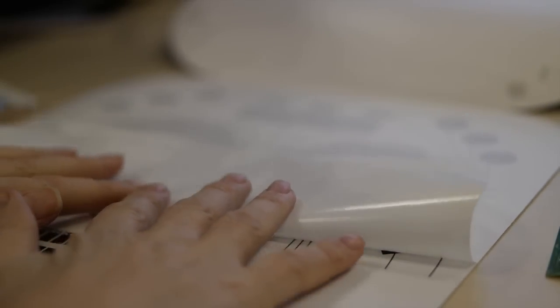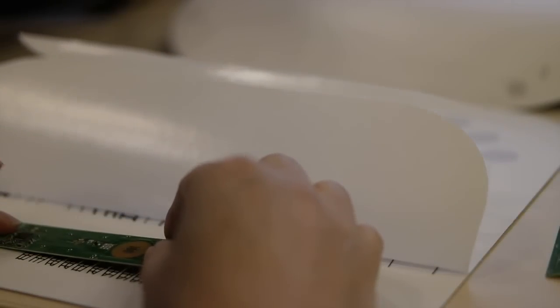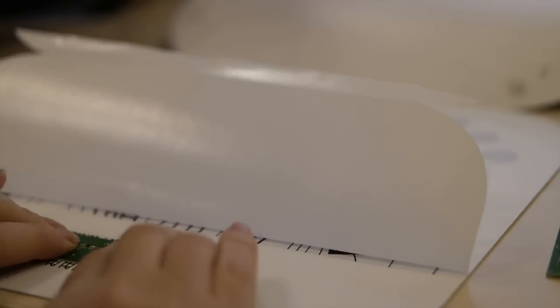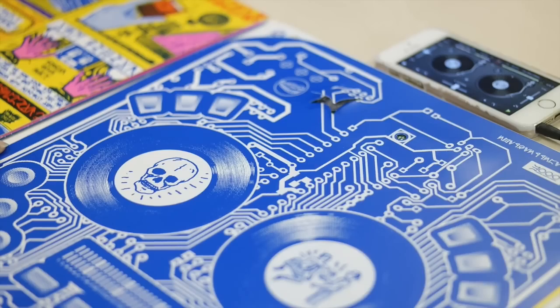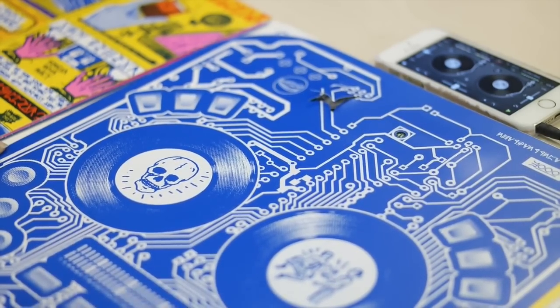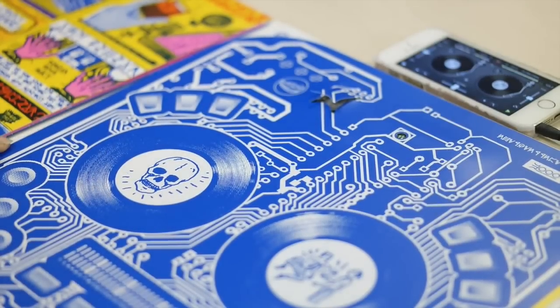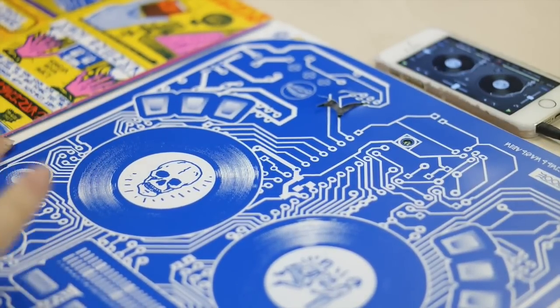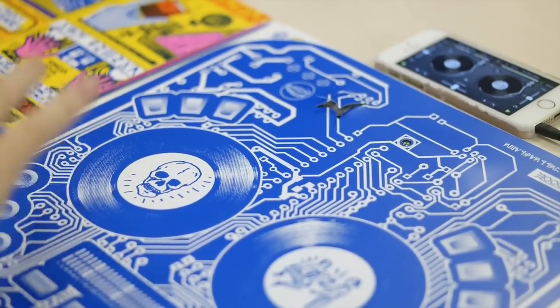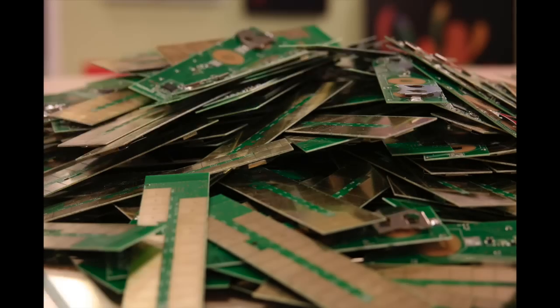This is made with one piece of card, one layer of printed carbon ink, and one chip which is running software for both Capacitive Touch and Bluetooth 4, and that connects to one actuator. So the challenge has just been bringing all of that together — how on earth do we make one, and how do we make a thousand?